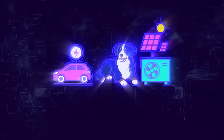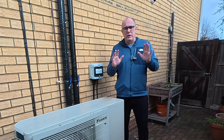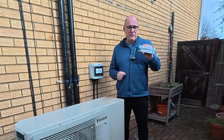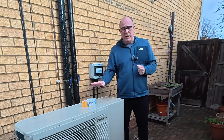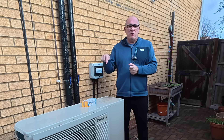Today we're going to put that to the test — in fact over the next month — and we're going to see if there is any indication that Legionella is growing in the tank upstairs. I just happen to have three Legionella test kits. This is not a sponsored video; these were purchased off Amazon. There are plenty of other brands out there but this one has generally had good reviews. These cost about £25 per test, so we're going to limit ourselves to three tests, and today we're going to run a control test.